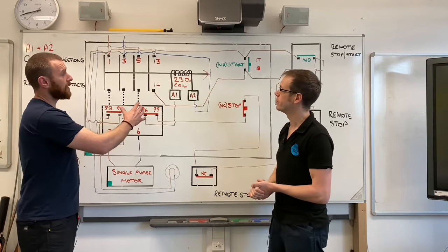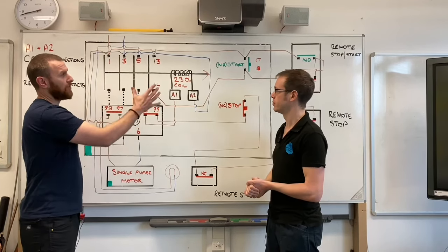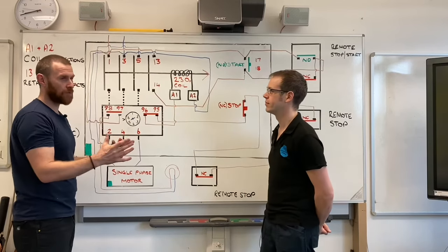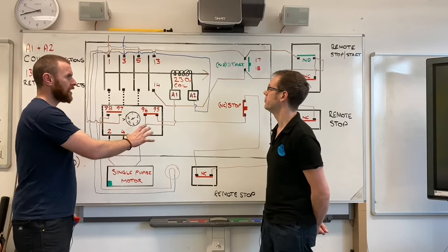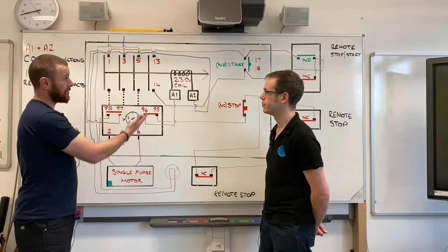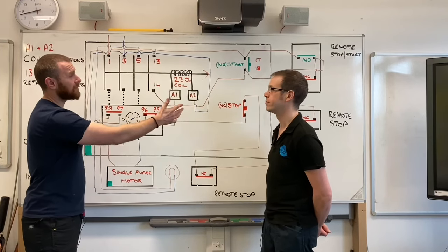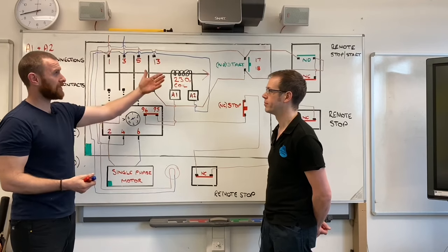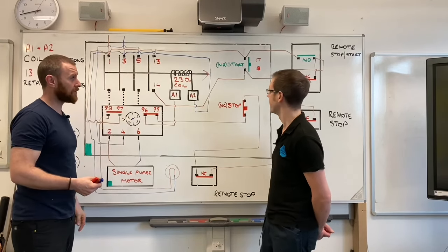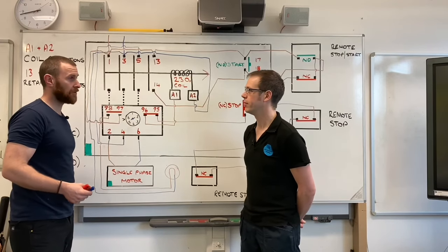I mean, in industry, there's other things that can go on with wiring these, and especially when you go up to one and you can see multiple wires going all over to time switches as well. But the basic operation to get a motor working is through a direct online starter. And yes, it looks more complicated, but in reality, it's not that complicated, as long as, like you said, you just take it one conductor at a time and you think about what you're doing as you're following the circuit through. Break it down into stages.